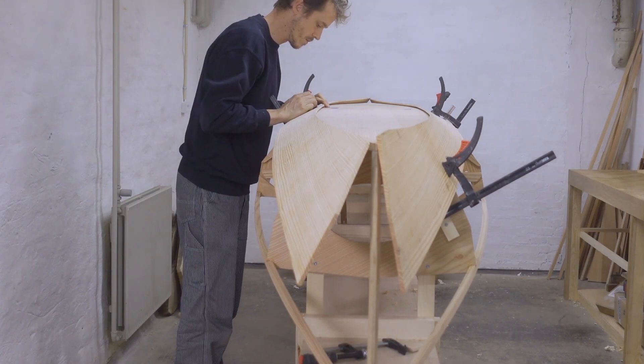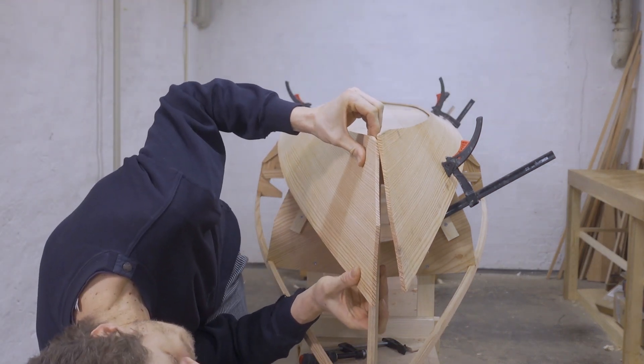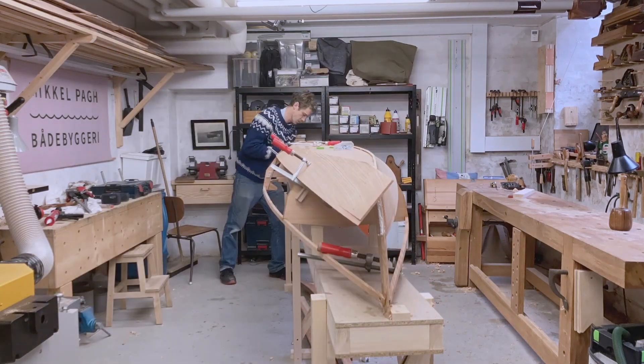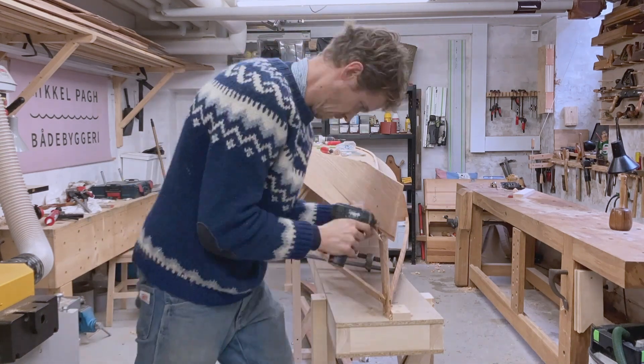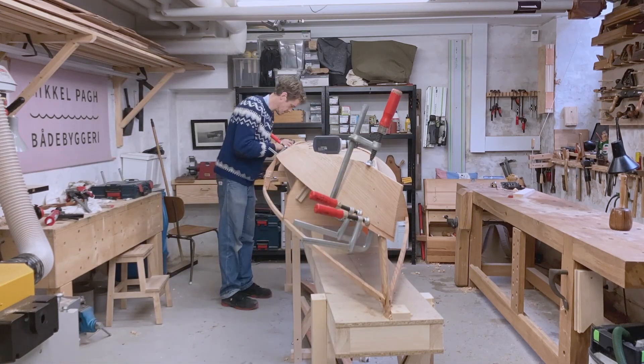The plank pair has been cut and thickness planed. The garboard plank is by far the trickiest one to install because there's so much twist in it. The plank orientation changes from being not all that far from horizontal at the midframe to being vertical at the stems. When the plank is twisted into place the bond between the wood fibers is stressed, which can cause the wood to split at least if the necessary precautions aren't taken. When I built my first fiddlehead canoe I didn't take the necessary precautions, which made the installation of the garboard plank quite a stressful experience.